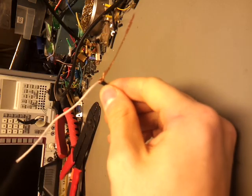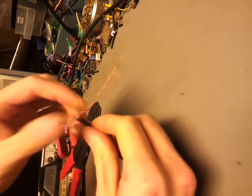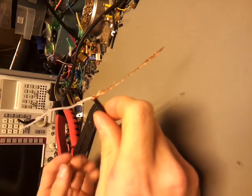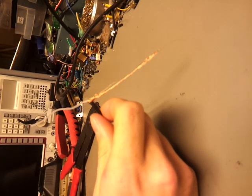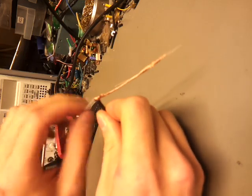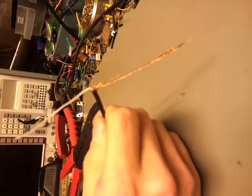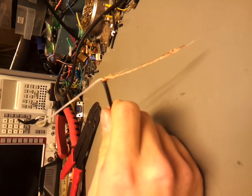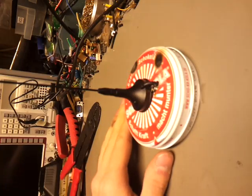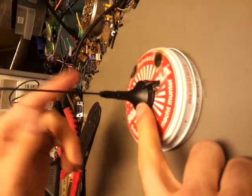It's crap, but it's fast and it should be less crap than the original mag mount, and it's somewhat tuned to the frequency, so you might hear something. But the coax used here is usually something like RG174, which is quite lossy, and it's some Chinese no-name coax anyway. But it's an easy and cheap way to experiment, and you can use the original mag mount for something else, like mount it on a chocolate container and build something like a comb generator or a beacon out of it.